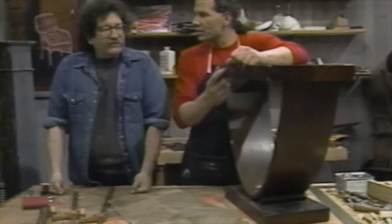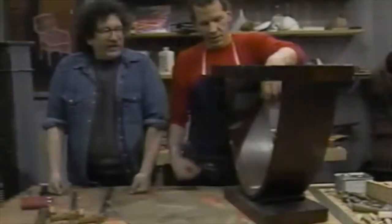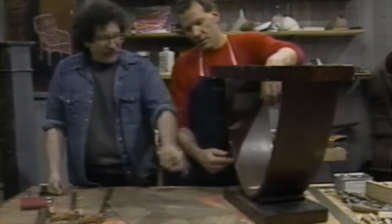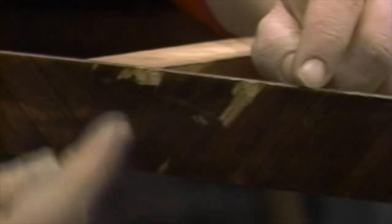You've got a veneer problem like this one, you've got to do some serious work. It's a deco table — American deco, that bent wood. It's walnut. If you can see around here, this grain is bookmatched, very similar to this new piece that we're going to use. The reason this is a more complex repair is because the repair goes actually beyond the veneer — it's broken into the plywood or underlayment. So we've got to repair a piece right here at the seam, and out here.